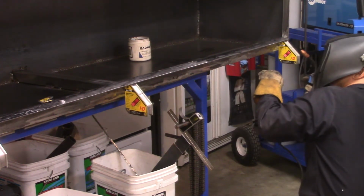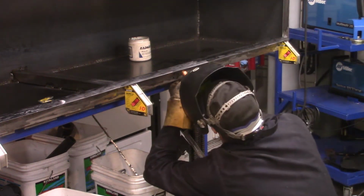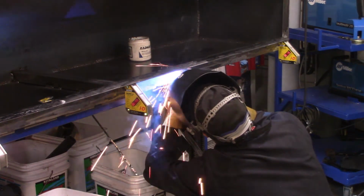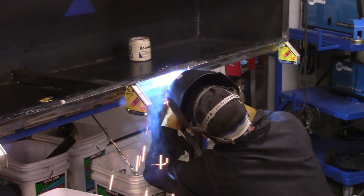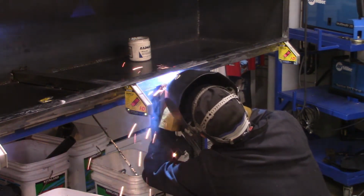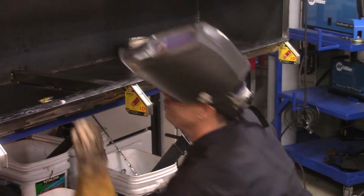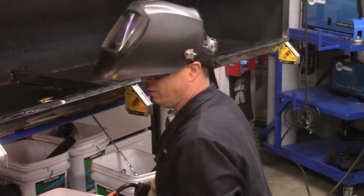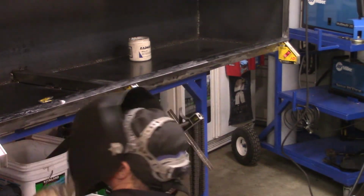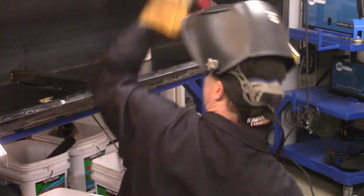I got that idea from a toolbox that I have on my truck. Typically, the way something like that is done, I believe, is they just form it at the factory. They'll take a piece of steel and use a handbrake and just bend it over. But obviously I didn't have a handbrake that long, and so that's why I had to weld all these seams, even for the panels on the box as well.